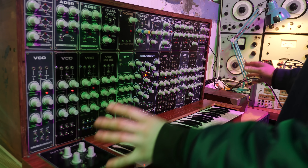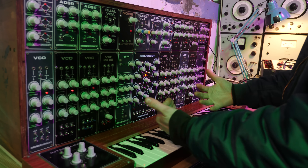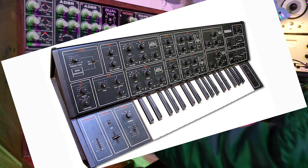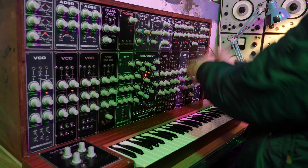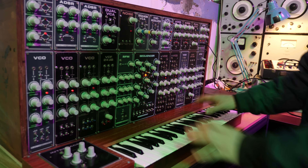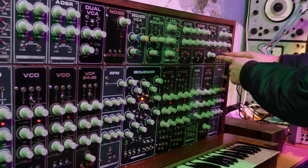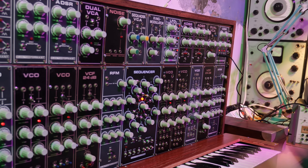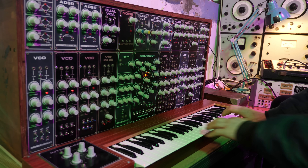So it's set up like a dual synthesizer — two separate synthesizers running in parallel, the same as the Yamaha CS15. Each has an oscillator, a filter, envelope generators and VCAs — two of them running in parallel so you get two separate synth sounds at the same time, albeit controlled by the same note because it's still monophonic. Right now they're both going via the mixer around the back of the COM module, coming out in mono form. In a second we're going to do a stereo thing, but let's listen to only this synthesizer first — it already sounds like a 1980s electro pop banger.